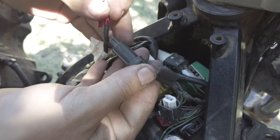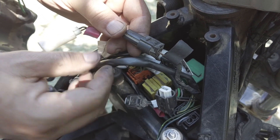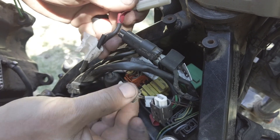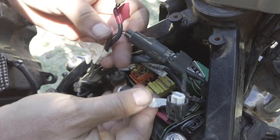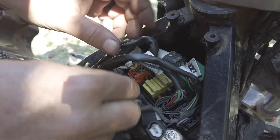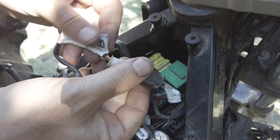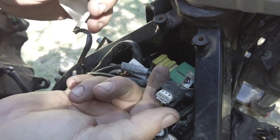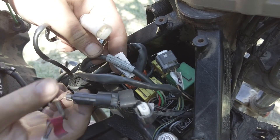Most of these connectors are different enough that you don't have to worry about mixing them up, but for ones that look similar we've gone through the process and labeled them. You can see we've got two red pieces of tape here — those connect together. We had one section where we used two white pieces and named them B. These are all ways you can mark connectors so you know which ones go back together.